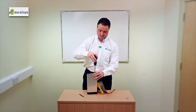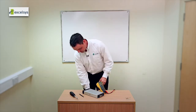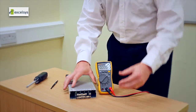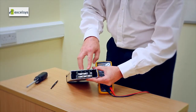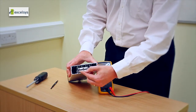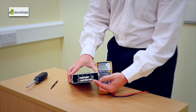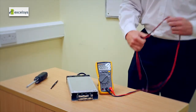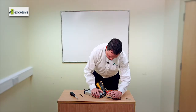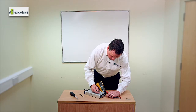The reason we ask you to set the voltage accurately is to improve the current share. We go ahead and turn the module on. The four LEDs are turned on — the other modules have already been preset to 24 volts. We then measure the delta V between the adjacent modules and try to get that below the 10 millivolt range. In doing so, we can achieve a plus and minus one percent accurate current share.